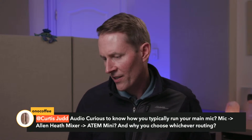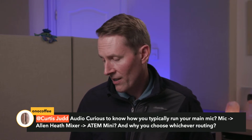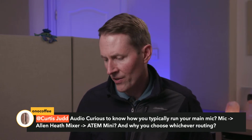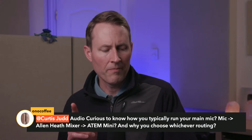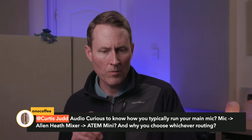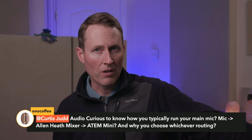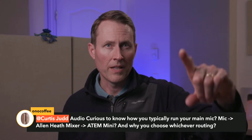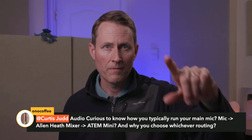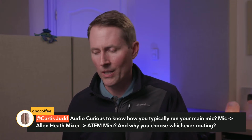Okay, Ono Coffee is curious to know how you typically run your main mic to Allen & Heath mixer to ATEM Mini, and why you choose whichever routing. In this case, for the live stream, I almost always go microphone, Rupert Neve Designs Shelford channel, which has a compressor and an EQ on it. Then that goes into the camera's XLR input at line level, and then that goes to the ATEM Mini. So that's typically how I do it.